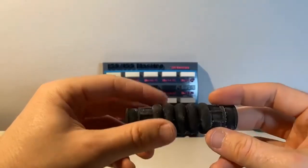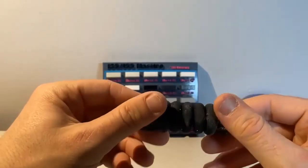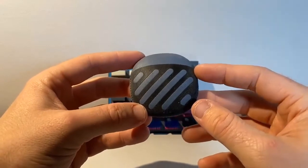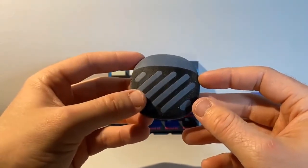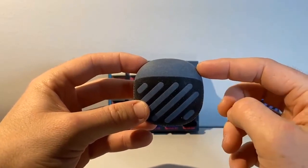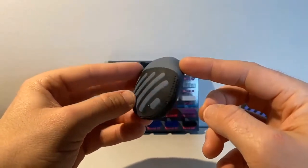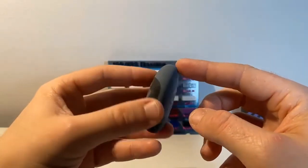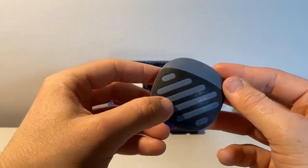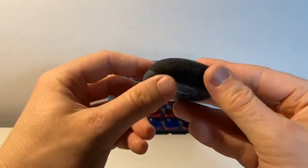The surface of these parts is a little tacky — there are techniques to remove some of the tackiness from flexible 3D printed materials and we will link to that video in the future. Here we've taken Elastico black and done a digital material blend with Elastico black and Vero ultra white to get this flexible gray solid body, while we have this over-molded simulated Elastico piece.